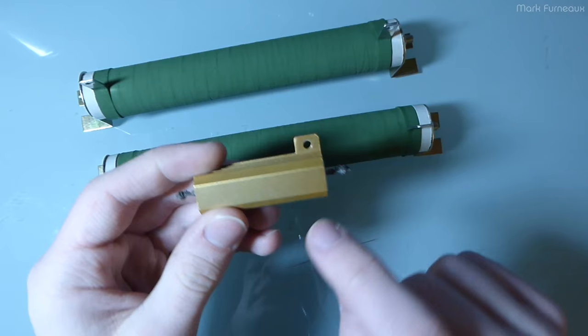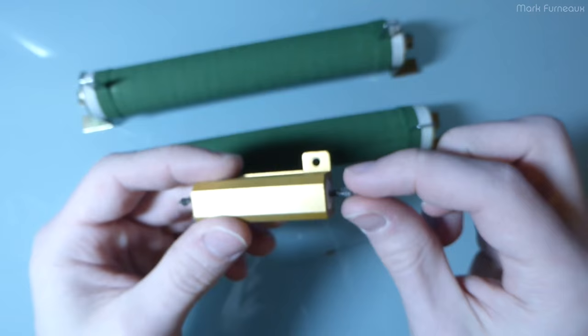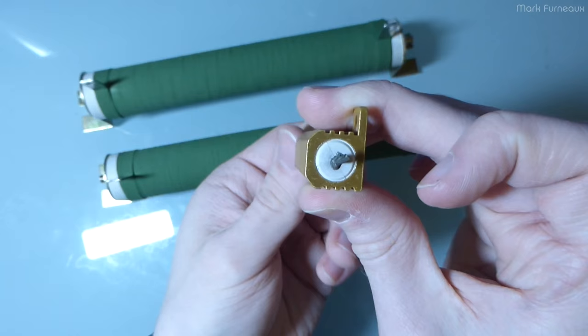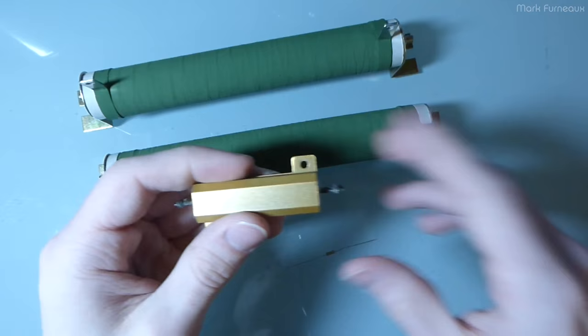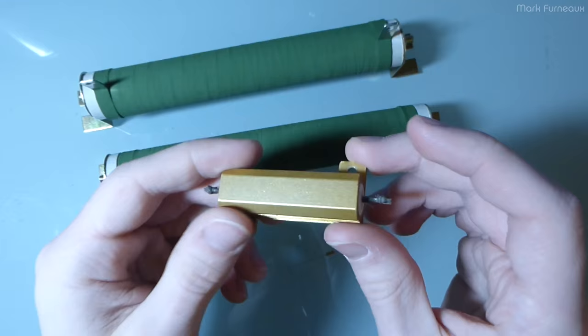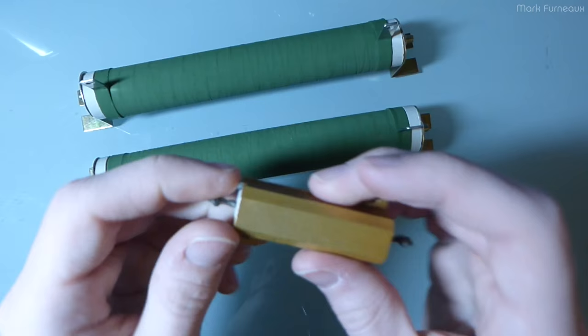The aluminum extrusion type has an overload rating as well, but I've seen them fail. Due to the way they're built, when you overload them they're kind of like a spring and they'll blow out on the ends. You can actually see this one — it's loose, it actually spins inside its housing. What happens is it blows out on the ends and the wire generally won't break, so you have this thin wire extending several feet from the metal casing, which can touch stuff. That's really dangerous because it's still connected in circuit and you don't know the voltage.